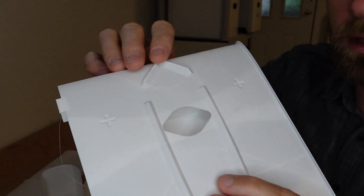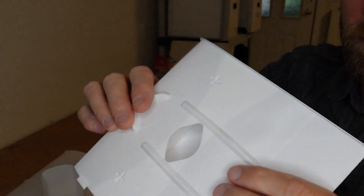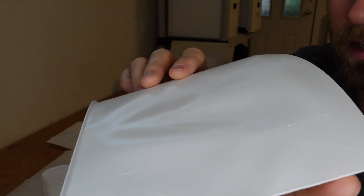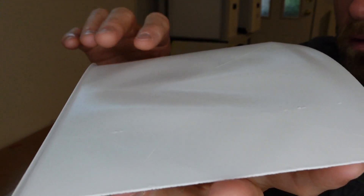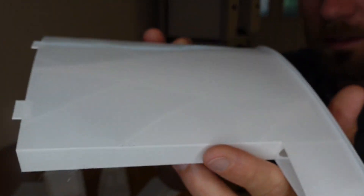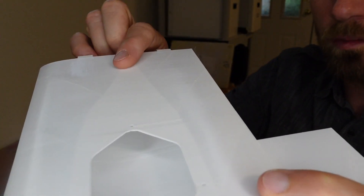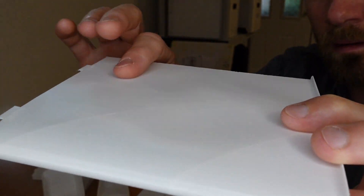The PETG pieces didn't turn out quite as nice as the PLA ones but they are still significantly better than the lightweight PLA. The ones that turned out the worst were the wing tips — they have a much bigger surface area and there's a bit of warping between each of the internal supports, with some sections bowed in and some bowed out. The smaller pieces turned out quite well with much less warping, likely because there's more internal support. The other wing pieces show only a tiny bit of warping.